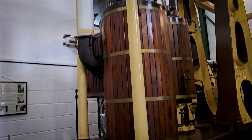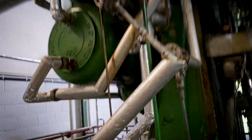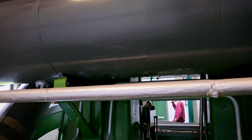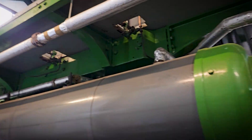Looking for the Dover House. It's quite warm, so we'll back this off a little bit. And the actual Dover - we've still got the cylinder cocks open on this one, and the cylinder heaters. The cylinders are all the way up there; we can climb up there, but I can tell you it's not warm yet. It's still gurgling and bubbling. There's no way it's warm yet. This takes a good 2-3 hours to warm up properly. Back in the day they used to warm it up for the best part of a week, just to be safe.